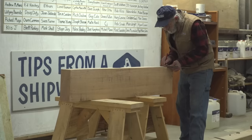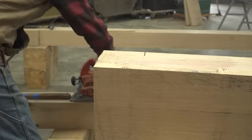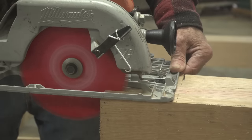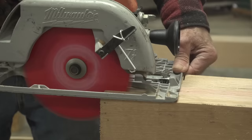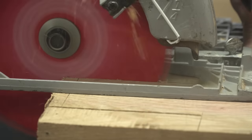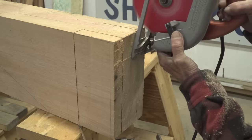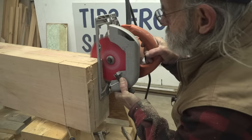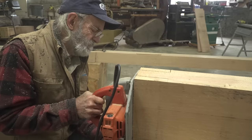We're back on the stern post now, marking out our tenon with a nice little square — it's got to be accurate. After that's done, I do most of it with a skill saw. It's kind of like the mortise — you can't get the whole thing done with the skill saw; it leaves a little bit of work at the end at the radius. I'd have to pick this thing up, put it on the bandsaw, and fool around with it, but believe me it wouldn't be anywhere near this easy. The saw moves and the piece just sits still, which makes it really easy. Cutting downhill seems like it wouldn't be easy, but it's not bad — cutting uphill or horizontally is really difficult. This is the easiest way.